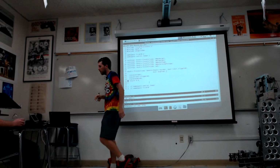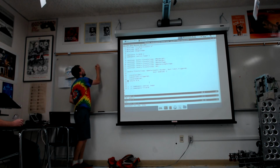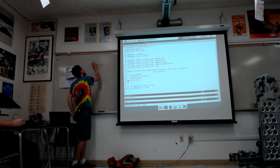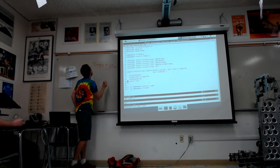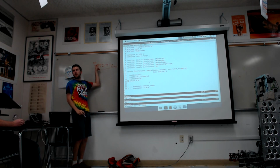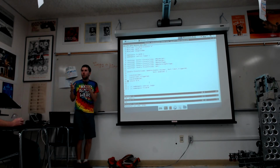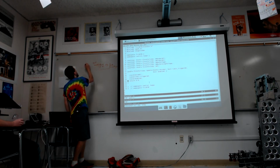The software design pattern I like to use for this is I like to chain things together. So we'll have a little control loop, a little PID loop. This is going to take in a goal. It's going to output a voltage. And then we'll write a little piece of software that to implement zeroing changes the goal to move the robot. So we have one piece of software that's designed to move it in a controlled fashion. And then we have another piece of software that either does what the user's asking for, or it moves it slowly to zero. Okay, I like it. It'll be a little state machine.